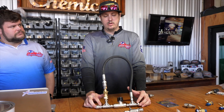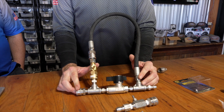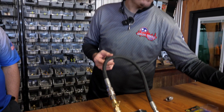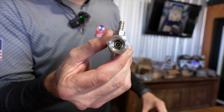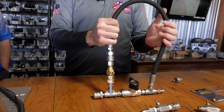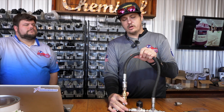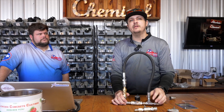This is really good because I don't have to stop my machine. When I go back to water, I can just open the flow up — water's going to bypass the injector and go straight for full flow. This is important because if you're running a high-flow machine, eight to ten gallons a minute, we don't always want our flow restricted by this orifice, especially if we're trying to achieve distance — like hitting a dirt dauber 60 feet up in the air. Any restriction back on the pump is going to affect that distance. Having a ball valve you can simply turn to achieve full flow is really nice. This also helps the life of the injector — if you're running six hours a day without a bypass loop, this injector is constantly working when it doesn't need to be.